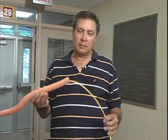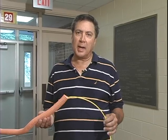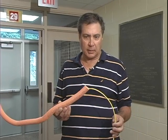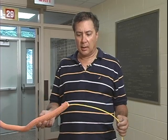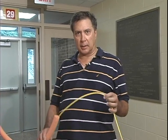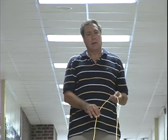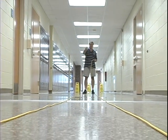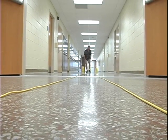We have our cable in from end to end, and it's time to call it a day. We're going to take the cable coming out of the inner duct — approximately 180 feet — and roll it up on the floor in a figure-eight pattern. Whenever you're rolling up fiber optic cabling, always roll it up in a figure-eight pattern; this way you won't get any knots. We've run the cable straight down the hallway and back, and it's all ready to lay down.